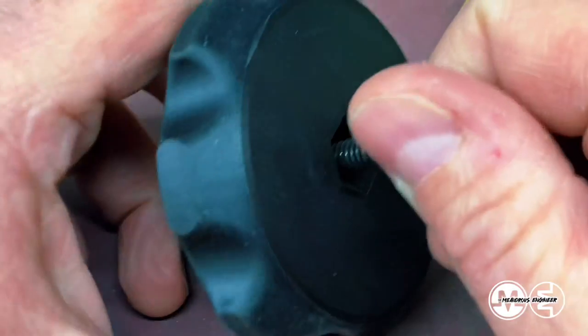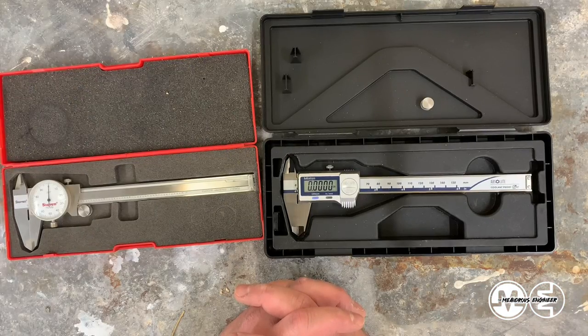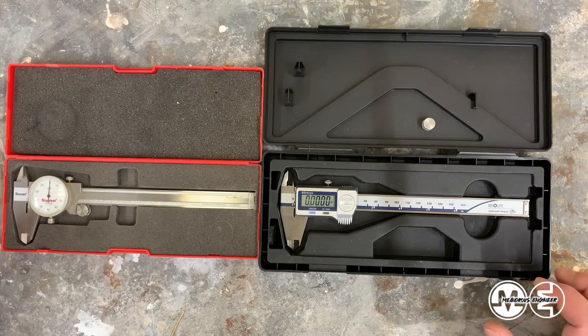If you're looking for slip fits, it's the same thing. It's within the degree of accuracy of a thousandth of an inch. I'll have to look and see what the metric equivalent of that is, but the logic still transfers. You should still think about this level of accuracy depending on what your use is. If you're doing woodworking, you could be within a 16th, but I would wager when you're doing those bow ties and you need to make something perfectly fit, you might want to measure it a little more accurately than that.